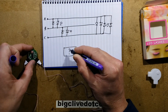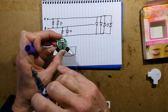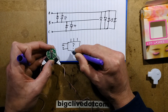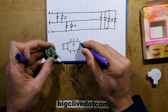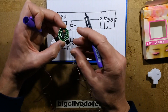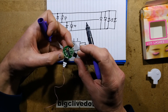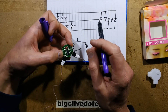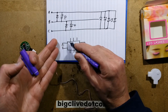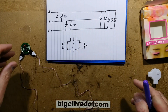The circuitry is super minimalist — they're relying on the fairly chunky CR2032 lithium cell. There's a mystery chip: it's a 16-pin chip but it looks as though they've rubbed the number off with a solvent, because there's a slight skid mark on top. The circuit is very simple: the battery is connected directly to the chip, three lines go off to one eyelash, three lines to the other, and there's a button. Oddly, the button appears to be connected between input and output rather than to one of the rails — possibly because it looks designed to have had two more buttons.